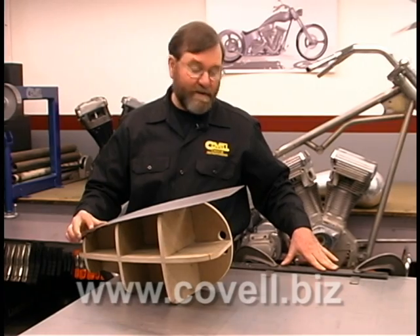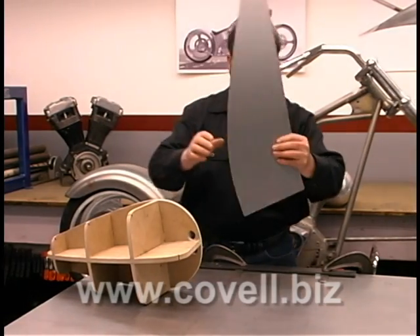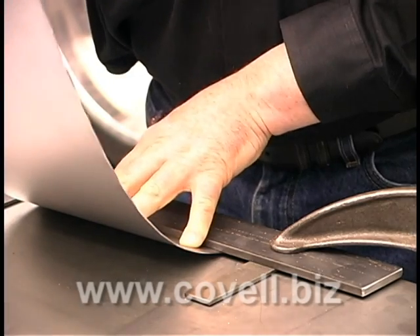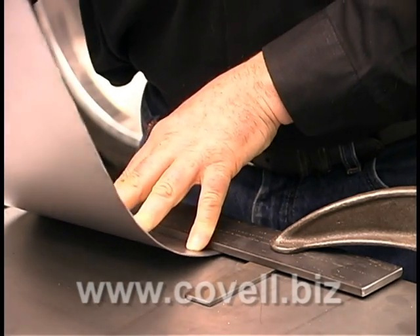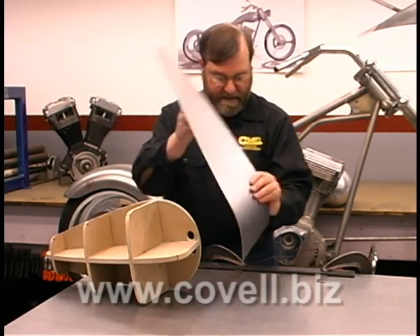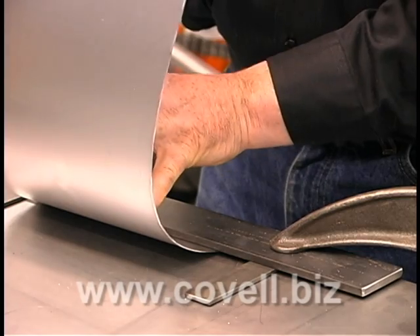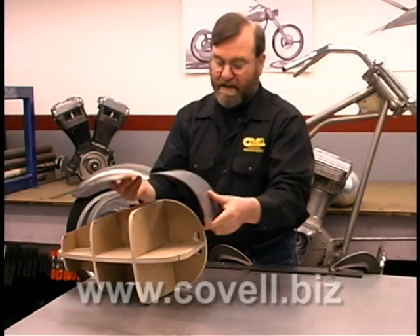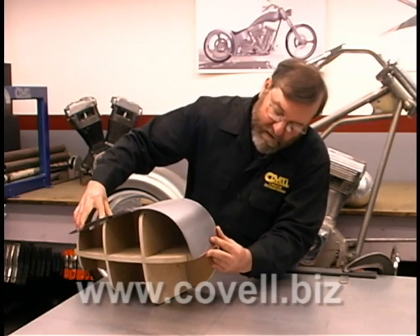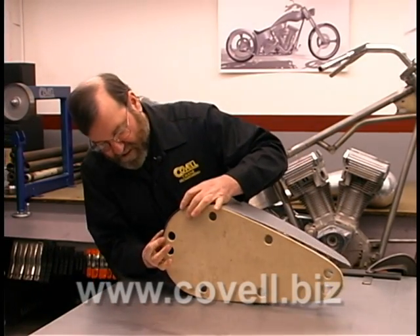I've clamped a piece of scrap steel bar to my table, with 1 and 1/8-inch thick spacers that raise it off the tabletop 1 and 1/8 inch. That provides an opening allowing me to slip the metal in and then pull it up to put a bend in it. We'll do this in several stages — bend it just a little bit, go back to the buck, see how the form is coming. It needs quite a bit more radius, so we'll go back into the fixture, bend it a little bit more in that one area, test it on the buck again. And we're fitting pretty well — just about perfectly dialed in.